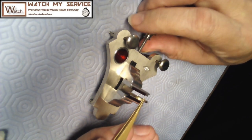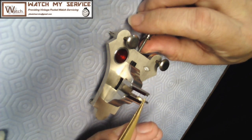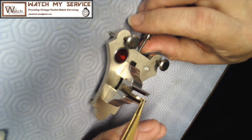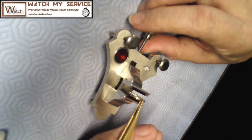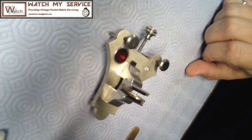I don't want the shaft of the balance staff touching the jaw - it should be the pivot tip. So I had to open my tweezers up a bit so they fall down like that. That's a little misaligned because the pivot on this is broken. I should find another balance with a decent pivot so I can lay this down nicely. But that's what it should look like right there - the pivot tips resting on the ruby jaws.